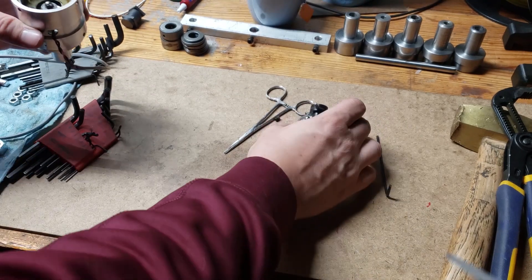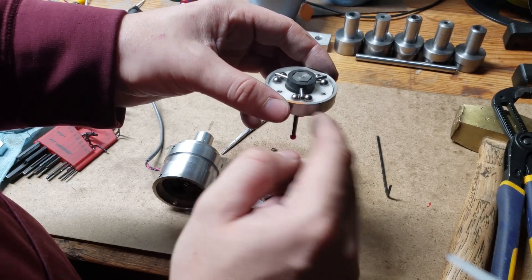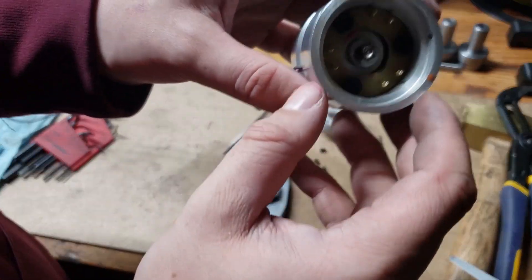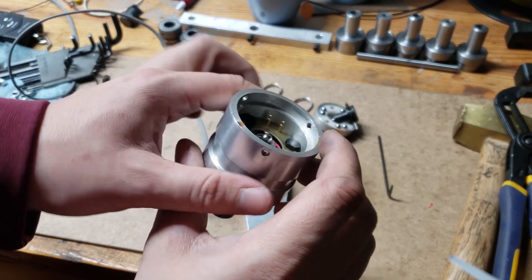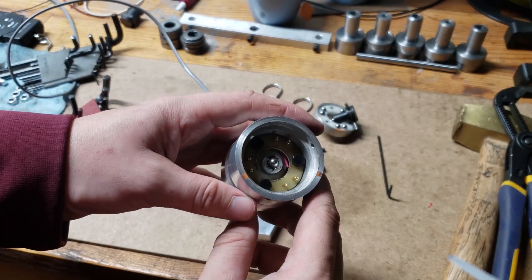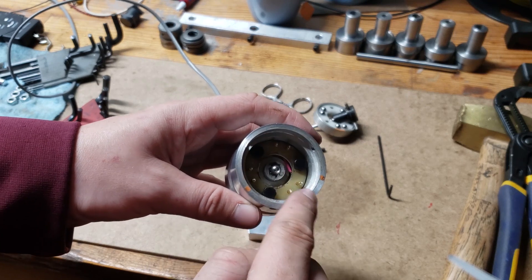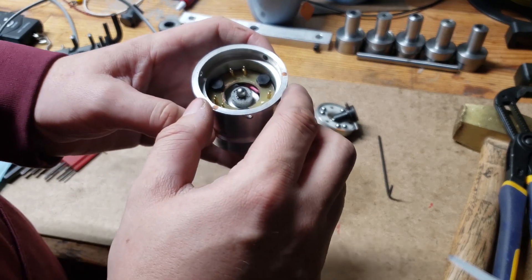The way the circuit works: when this lifts up it breaks the circuit — that's your switch. Right now current is flowing; if you touch something, current stops flowing. There's juice to these balls, and I have a circuit board in here with push pins that press down on the probe balls. These are the forks that apply pressure and voltage to the ball. Ground is here and positive five volts is here — it runs all the way around the circle and back out, so if any one of these pairs breaks, being in series, it's going to cut and trigger the probe.